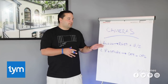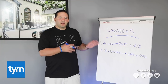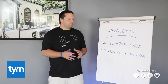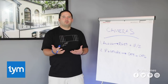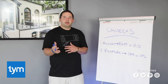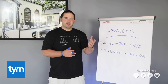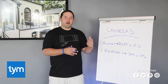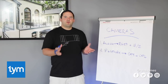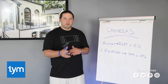Here's a cool tip for wiring up cameras. I've been in installations where dealers ran three wires — the RG-59, 18-2, and a Cat5 — so the client has the option to go either analog or IP. But the reality is that all you need to run is a single Cat5 or Cat6. Regardless of what type of camera you purchase, you'll be able to use that wire. If you do an analog camera, there's an adapter that converts the Cat5 or Cat6 to send both power and video to an analog camera. We rarely run more than one wire per camera unless the client wants redundancy in case a cable gets damaged during construction.